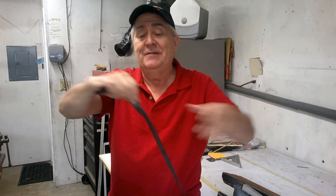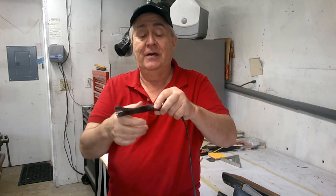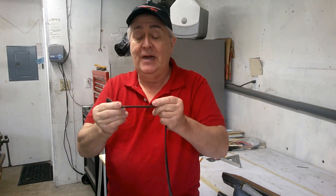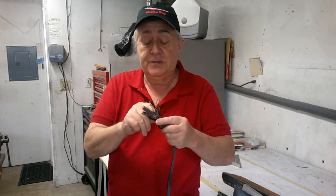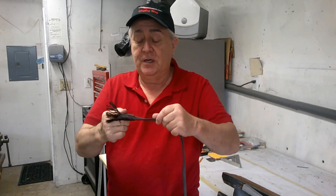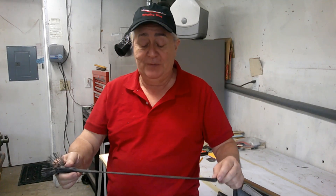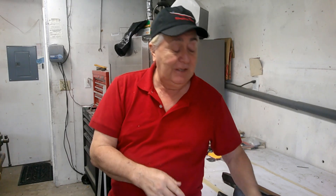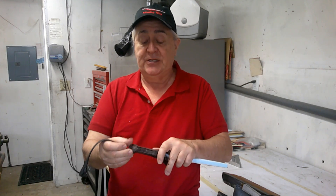Then, somewhere in the intervening years, they came out with these handy-dandy braided sleeves. This is a sleeve of carbon fiber fabric — like the finger trap toys — where you put your finger in, pull it, and you can't get your finger out. They get tighter as you pull them together. It's a braided tube of carbon fiber yarns. You can take this sleeve material and slide it over the foam core, pull it up tight, and then impregnate it with resin.